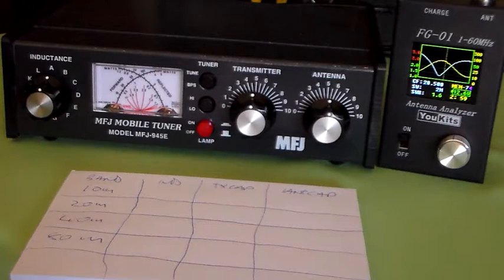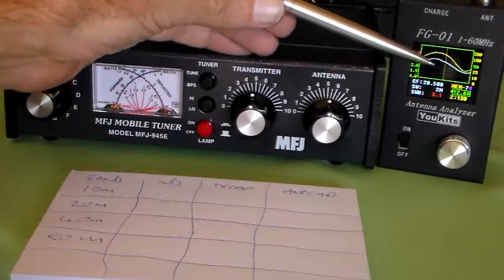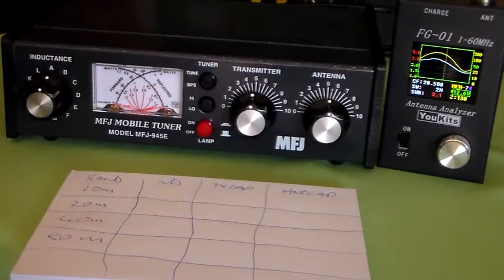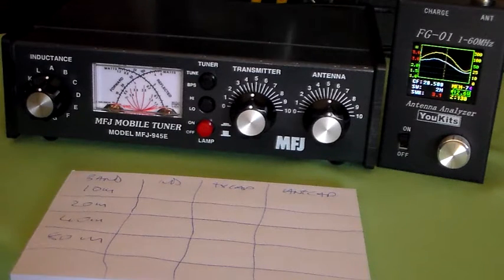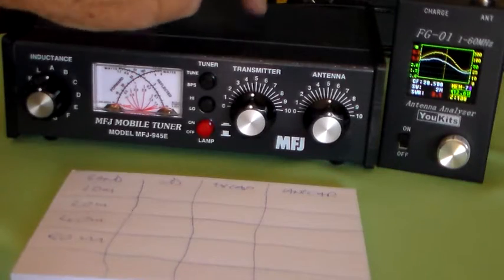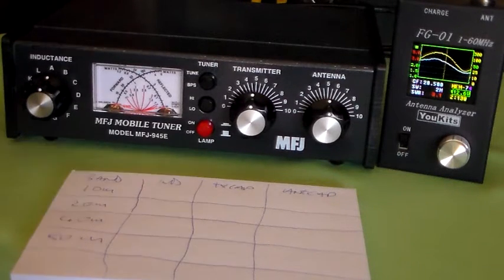Just a reminder — I'll bypass the tuner for a second. We can see there that's 138 ohms. This is what the antenna looks like without any kind of matching at all. It's a 3.1 to 1 SWR and 138 ohms on the antenna port. When we've matched it, that impedance on the antenna port will still be 138 ohms — it'll be 50 ohms on the transmitter port. And if you wanted to work out the voltage across that antenna port, it's the square root of the power times the impedance. So it'll be 100 watts times 138, then the square root of that.